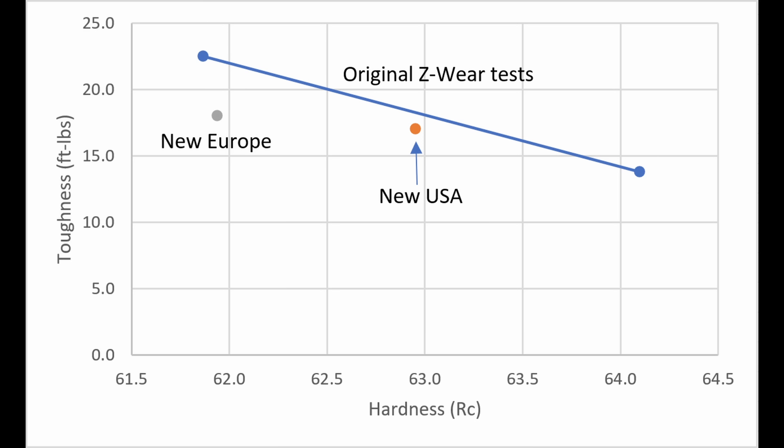Overall, in this impact testing with nine coupons, we did not measure a significant difference between the two companies. Whatever is happening with oxygen, it doesn't seem to lead to significant differences in impact toughness. I have not yet found a significant difference between different powder metallurgy tool steel companies in impact testing, so I think composition matters more than the company making the powder — at least for these reputable companies, which are all making pretty high-quality powder.